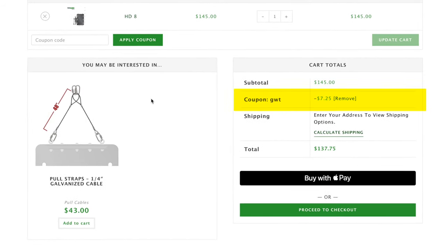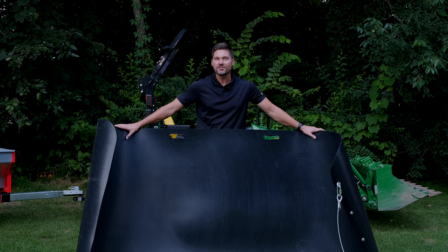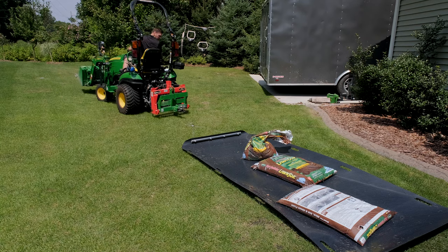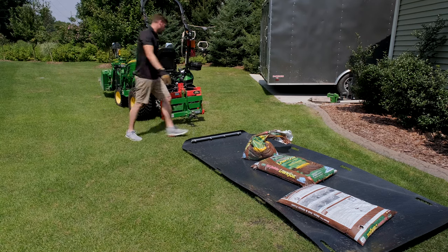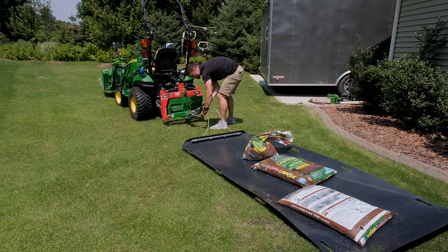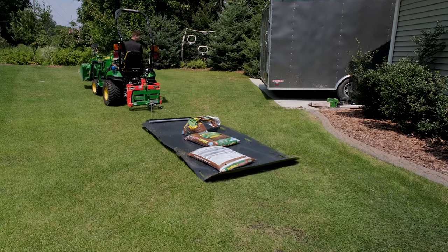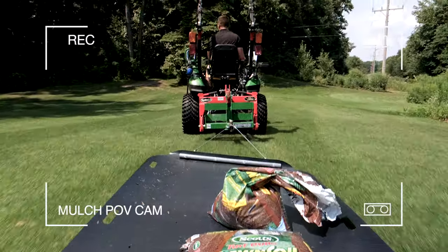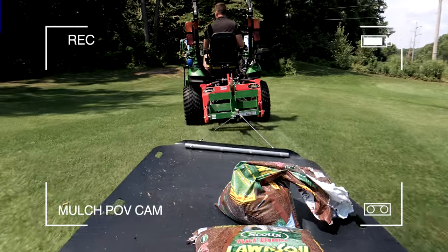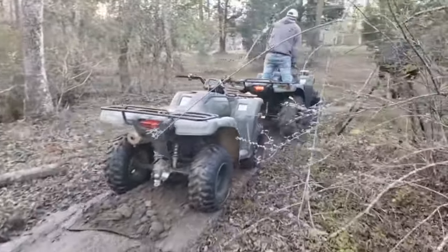UHMW is known for being a very tough and durable product. It's got a very low friction coefficient, which means it's going to slide or glide easily. In fact, their website warns you to be careful walking on it because if there are leaves or something on here, you may slip and fall. That lack of friction means it's going to glide — like the name suggests — over anything: grass, woods, snow, mud. We're going to include some of that footage in this video as well; they're using it in all sorts of different terrain and applications.